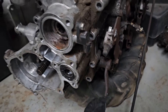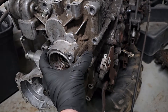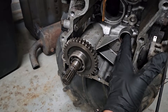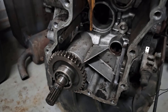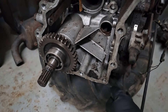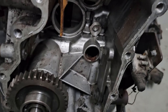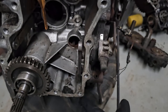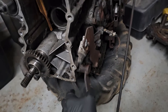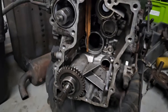Over here is your shifter. What I noticed with this one is very interesting. Your output shaft is going through all the way back to your hydrostatic. Your gear housing here - typically there's a bunch of gears in here, but they're not here. This shaft is going all the way back to the rear. Here's your gear selector. You know how it's hard to shift these sometimes? There's a little pin here that pops in and out, and it's actually kind of hard to shift. You kind of have to pop it and release a bit to get it to go in.